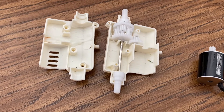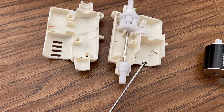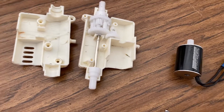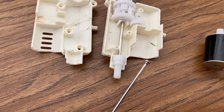Normally there's a side piece here. I had to cut that out, and a little part that held the back of the original motor, because the new motor — even though it's the same diameter — it's slightly longer and won't fit in the gearbox without cutting out the side of it and then smoothing out the bottom.